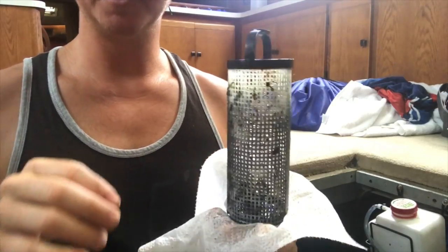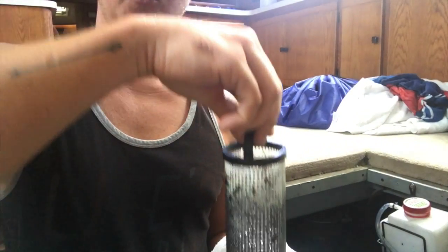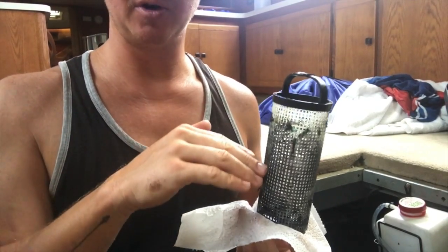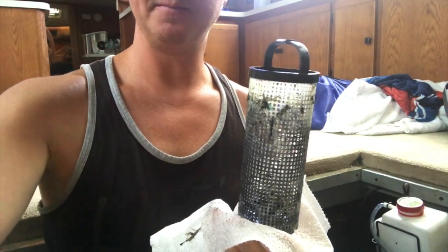Once you remove the cap, the strainer slides right out. As you can see, it's actually not that bad. Raw water comes in through the strainer and filter to cool the AC units. If these aren't regularly cleaned — especially since it uses raw water and we're sitting in a marina — you get issues with water flow, which could impact cooling and then damage your AC unit. This is just periodic maintenance. I wanted to make sure we did it before getting underway, and it's supposed to be done every seven days or so.